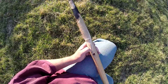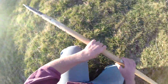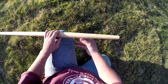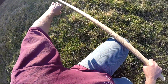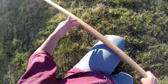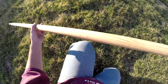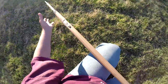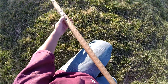I'll post another video after I do some testing and do a better breakdown of how I built this. One more thing: the back of this isn't complete yet. When you're throwing a long slender rod of uniform diameter, the weight is evenly distributed and it tends to rotate easily in flight. I want to taper the back end down significantly so that most of the weight is on one end, making it more difficult to rotate during flight and giving it a more stable flight.